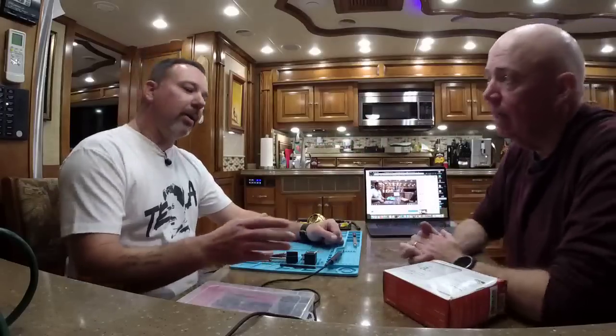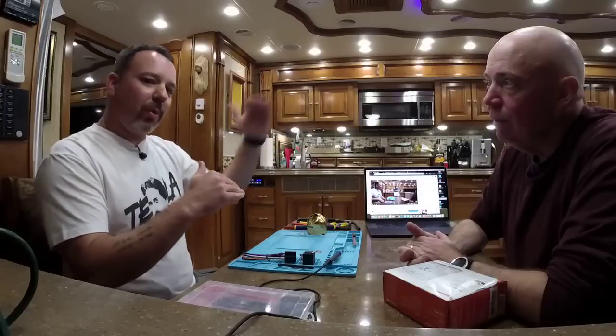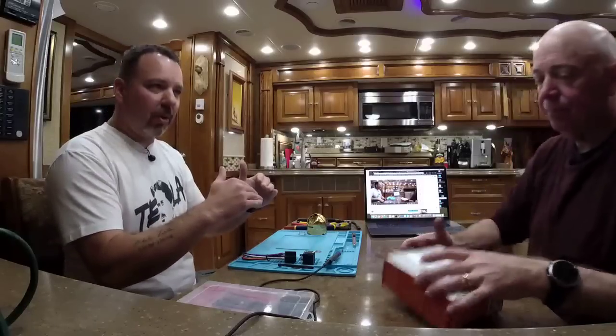Yes, exactly. Okay. And unfortunately, I haven't found a way to change that delta, what that temperature is. I believe, based on my experience, it's about 2 degrees. So if the temperature is more than 2 degrees above your set point, it kicks on to high fans. Then once it gets down, you can actually change this operation. You can set it to where once it gets within 2 degrees, it drops to low, or you can have it run high until it gets all the way to the set point. Then the next cycle, it'll be low.